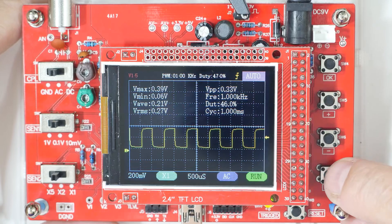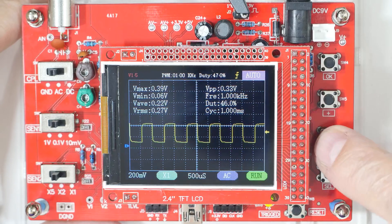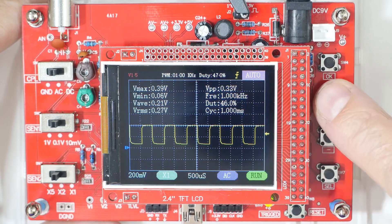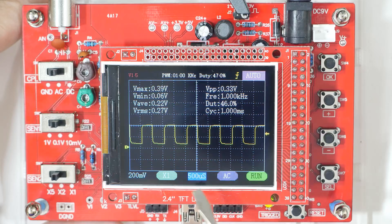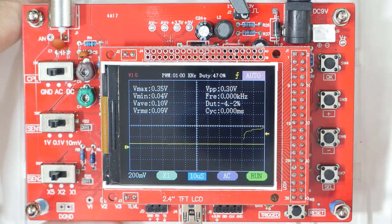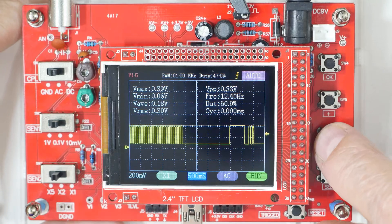Speaking of selection — press the select button the first time and a little arrow with a 1 on it turns blue. That is our probe zero point, and we can change that up and down. One more press and I believe this is the probe information — either 200 millivolts or two volts. Next press and the time scale changes to 500 microseconds. You have to press multiple times; it goes down as far as 10 microseconds and up to 500 seconds. Let's put it back to something more usable.